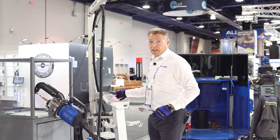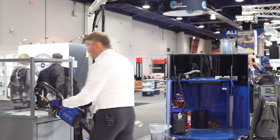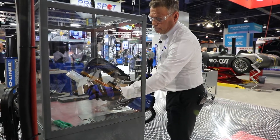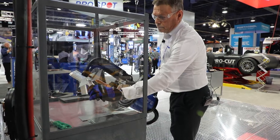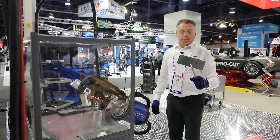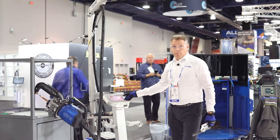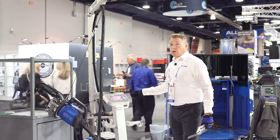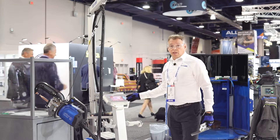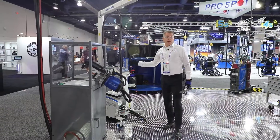I will now go up to the three-plate combination. You can see the second spot here, and in the display it shows 3.4 millimeters — exactly measuring the total thickness. It is calculated fully automatically, including accounting for the yoke I changed to 80.